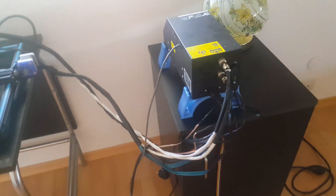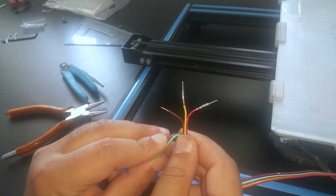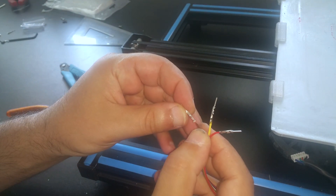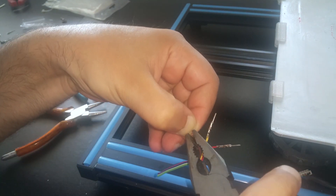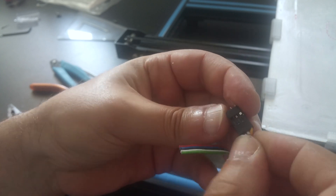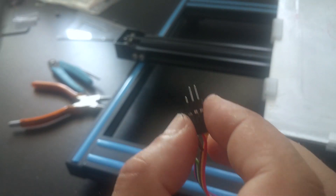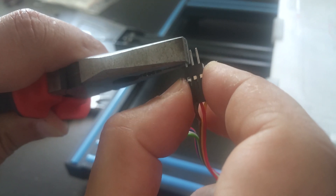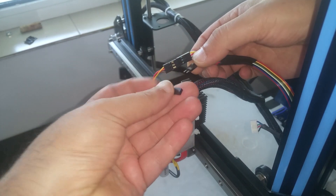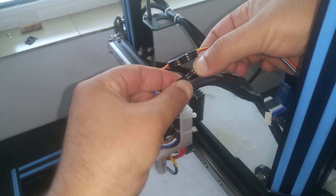I have already put a ribbon cable from the print head to the control box. I'll be using the included Dupont connectors to prepare my extension cable. The connectors are easy to assemble — no need for soldering. I use just pliers to fix the wires. I use the same color wires for the extension except for the black one that becomes green.